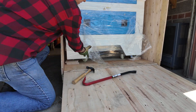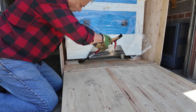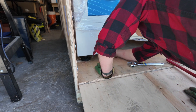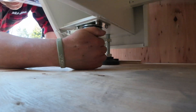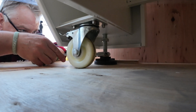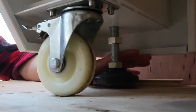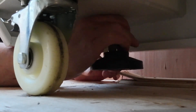The laser has four heavy duty casters, one on each corner, and right beside each you'll see a heavy duty rubber foot. Surrounding each of the feet you're going to find some pieces of plywood that have been nailed in to keep the unit from shifting during transport. Just grab your crowbar and peel them up — you're going to need to peel all four off because those pieces of plywood are actually holding the feet down. Once removed, slide in underneath, use your crescent wrench to loosen up that bottom nut. Also try to turn your wheels to face the direction you want to roll the laser out. After you loosen that foot and relieve the pressure onto the roller, you can easily spin that foot up a few inches to make sure it doesn't hit the ramp on its way out.